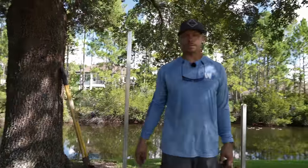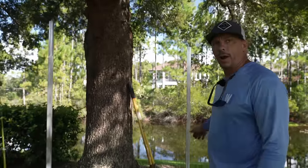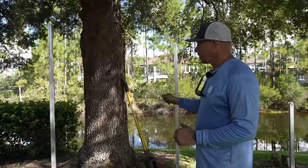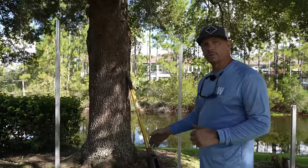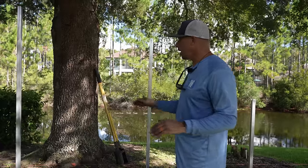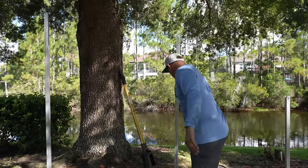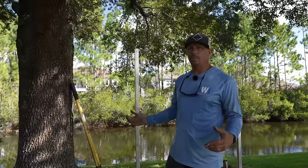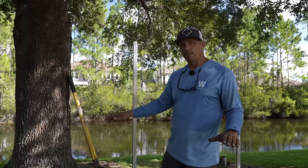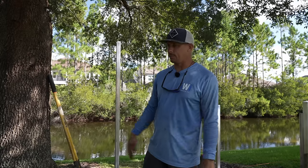Let's talk about this. We are here at the base of a huge live oak tree. We're two feet in the ground, the posts are solid — we're probably between a whole root ball, the posts can't pull out, and chances are if we started cutting through roots we'd find more roots down below and we'd just sacrifice the tree. The juice isn't worth the squeeze, so we're not going to fight to get another couple feet when what we've already got is super solid. I could bend this I-beam and the ground wouldn't give way — we'd just flat bend the I-beam over. So we're going to leave it right here, trim the top off, and let it be.